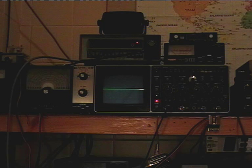I've got a tone generator connected up to the microphone socket, and I've got a tone going in there, so I don't have to keep saying 4, 4, 4 or 1, 2, 1, 2. You can't really adjust a PA section by saying 1, 2, 1, 2 or 4. You do need a proper two tones going in. And if I just key up, you'll see the actual waveform. Let me see if I can steady it up a bit on the scope.